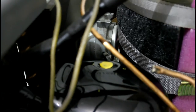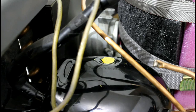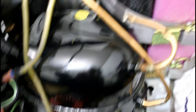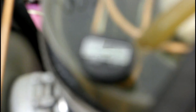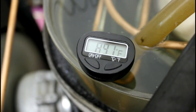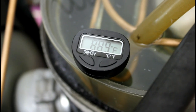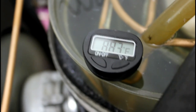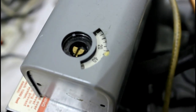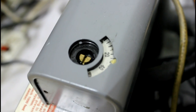Now it's settling back at two. But now that the compressor is running, it's only running at one speed, because the frequency of the incoming power is fixed, even though we have a very heavy load. The water in the chiller is really hot, but there's no mechanism to compensate for that within the system itself. It only runs on one speed, and it only uses this thermostat. But we can fix all that with a variable frequency drive.